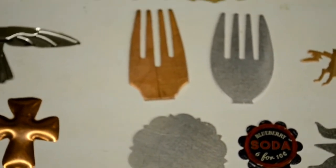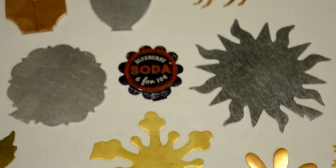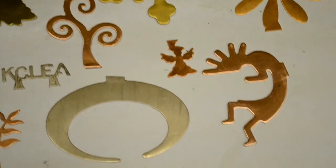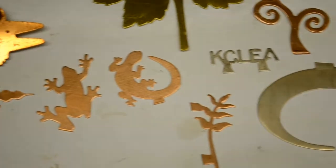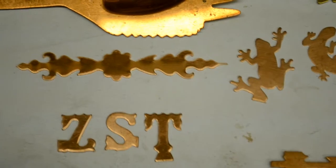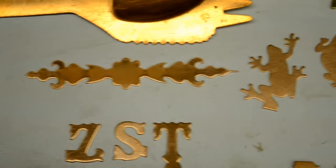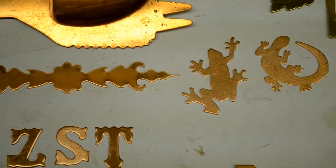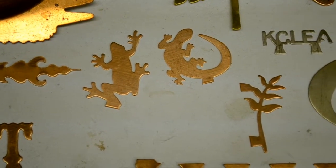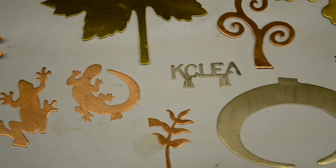Forks out of 14 gauge. Tricky little stuff. Basically, whatever you can saw out with a saw, you can make a die for, with certain limitations. You can't get too small or too thin. Parts of the die need to have mass and strength to hold up to the stress of cutting parts, of course.